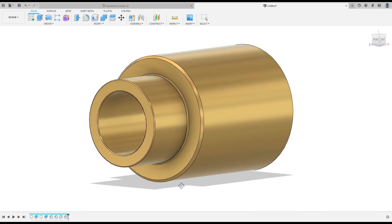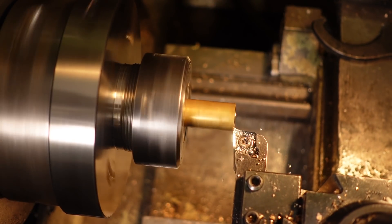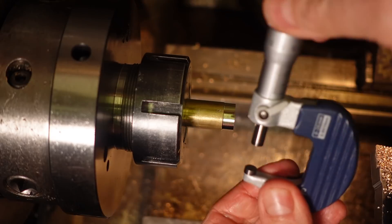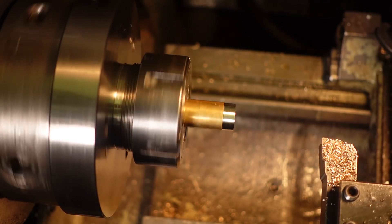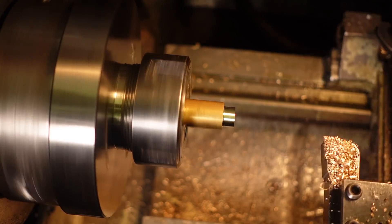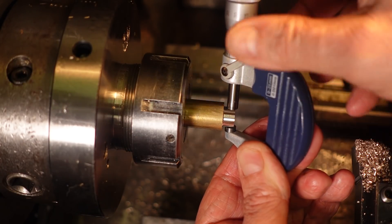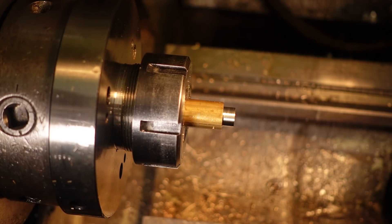I'll drill it to 8mm internal diameter, although the rolled bolts I'm using are actually a little undersize. This is a short section of 5/8 inch CZ121 brass bar, which is 15.8mm nominal. I'll take a light skim of the OD although it's not strictly necessary. The overall length of the collet is set to the required length under the head of the bolt. I'm using brass for convenience — I would normally use tool steel or 4140 or similar for smaller fasteners, but for this big one it doesn't really matter. As my ancient new-old DRO doesn't have individual tool offsets I need to measure the workpiece rather more frequently, but this Mitutoyo is such a joy to use that I don't care. It looks like that's a decent fit in the 11mm hole in the chuck, so now I'll skim the OD.